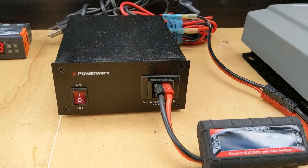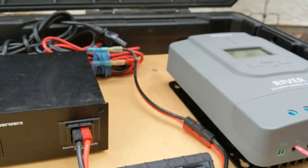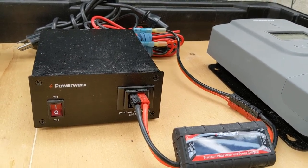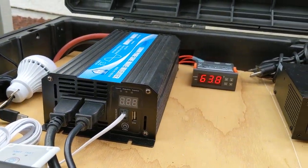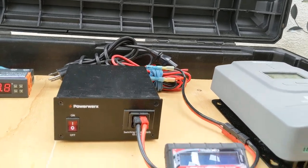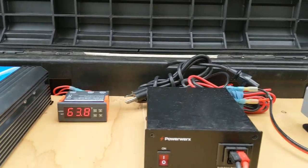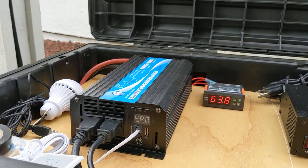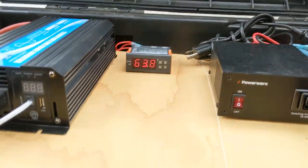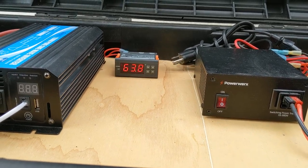The last connector on the bottom is going to be for power poles. Next I'll show the inside — the guts. I have an Interstate marine battery in here. Just one right now. I'm going to run them in parallel to increase the amperage but keep the voltage at 12 volts since this is a 12-volt unit. Or if I increase it to 24 volts, I'll get a 24-to-12-volt converter. There's plenty of room down below — I could probably fit four full-size batteries in here. It'll be heavy, but it's got solid wheels, a nice handle — it's mobile. I can move this anywhere I need to, and the lid stays shut so it's self-contained.